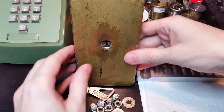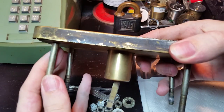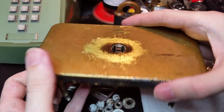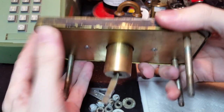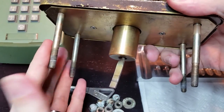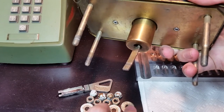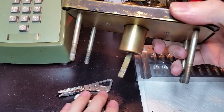This is a version that is housed in a similar to a Medeco Bodyguard, very thick, heavy steel housing, which is designed to give you all sorts of brute force resistance. It has a rim tailpiece, and these bolts fit all the way through the door, and then it has a series of washers and nuts that go over the end to protect it.